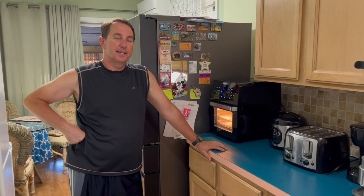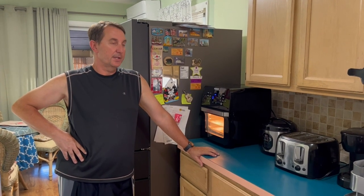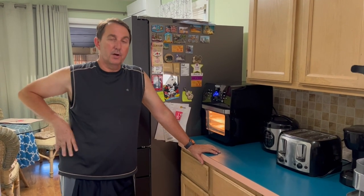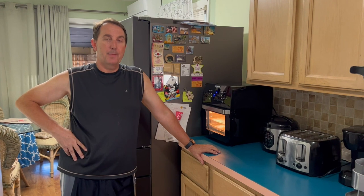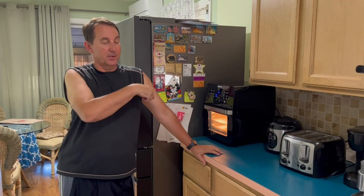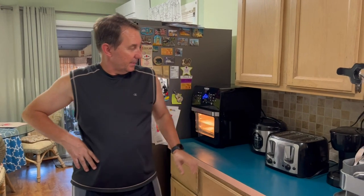The kitchen is supposed to be served by two 20-amp circuits — that's the new code. A 20-amp circuit on one side of the kitchen and a 20-amp circuit on the other side. Even with that, you still might have some tripping. And what's odd about this case is the new code says we are supposed to serve these kitchen outlets with an arc fault breaker. So what is happening is when you turn on a light in another room, it will trip the entire circuit because this is on an arc fault circuit.